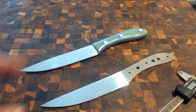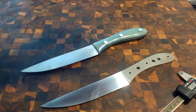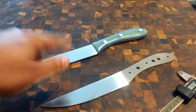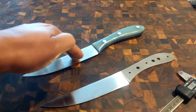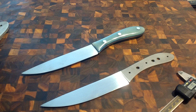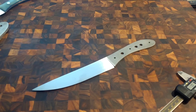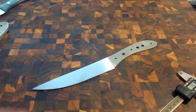But Vanax is much softer — it can only reach about 60 HRC. If you push the HRC, you remove all of the incredible stainless properties of this material. So I didn't take this one as thin; it's tough for what it is, one of the toughest. This is actually the toughest powdered metallurgy stainless steel, but we're exploring some of the more conventional PM stainless steels — this one is very exotic and very expensive. Let's set that aside and talk more about 4V, because the fact that we're at 64 HRC and tougher than most steels is just insane.